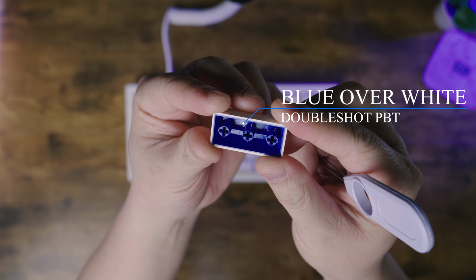Now, this is my favorite part of the keyboard. This is a per-key flex-cut hot-swap PCB, where every key gets personal attention in the flex department, with a few exceptions, of course. Combine the gasket mount, the bendy PC plate, and the per-key flex-cut, and you get this soft give that translates into a really nice, smooth typing experience that just feels great under your fingers.